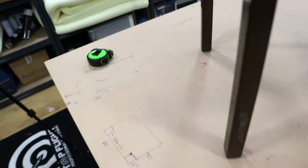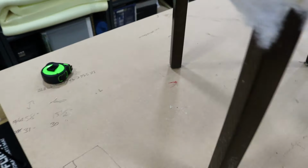Normally the back would go on first, but because of the way this seat has to finish underneath there, see, I've had to put a couple of screws in to reinforce the frame. Because the back has to come underneath here and all the way down to the bottom, I need to put the seat on first, and then the back goes over the top. That is how to cut a seat, and then we'll go on to fabric and cut in next.